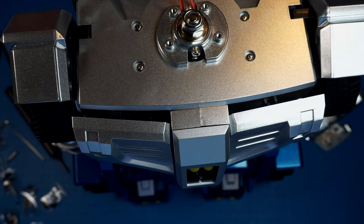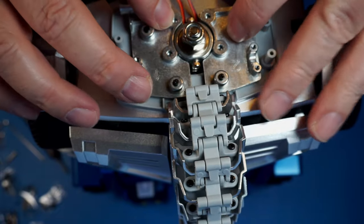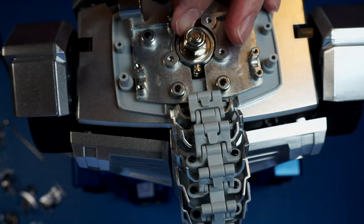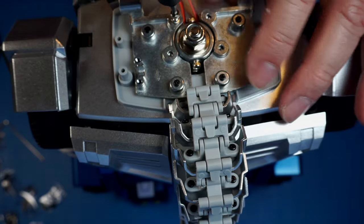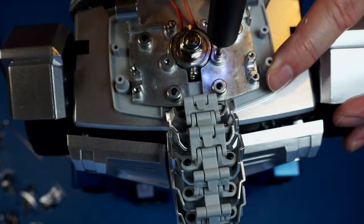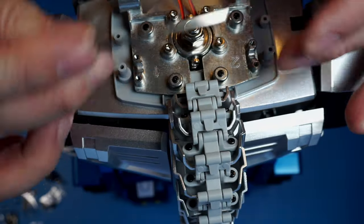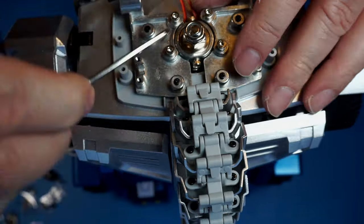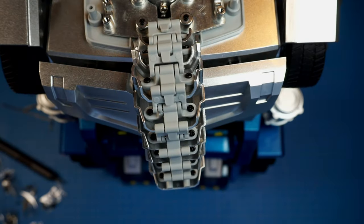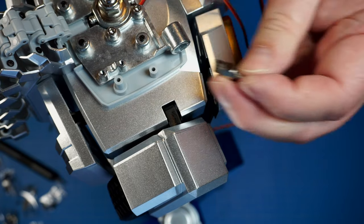Okay, let's get the legs back over. We're going to be putting this on too. It's going to go on just like this. I'm going to screw those down with 4 of the M3x8mm screws with lock washers on. Here, here, and here. Helps if you have it in gear. Use this wrench just to make sure they're very tight. Okay, there we go. Now we got 2 TRL75s. That's the one to go with the bolt side going in.